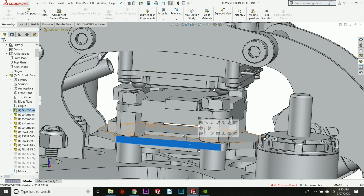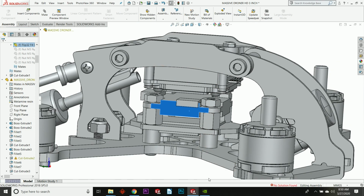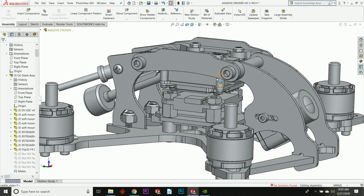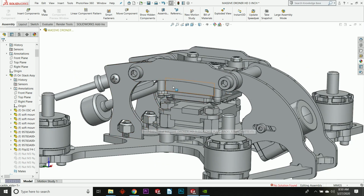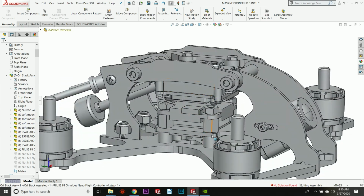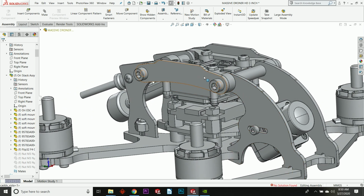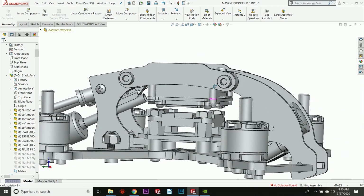So you've got your all-in-one ESC, you've got your flight controller, micro flight controller, and then just stack this thing on top of it and run really long screws through. That, in my opinion, doesn't work very well. First of all, you have a stack that is extremely high up, okay? So when you have a stack that's that tall and you go crashing into things, I'm sorry, but you're going to run the risk of damaging your stack and damaging components because it's just so tall that there's a huge moment that's put when, 70 miles an hour of ground or race gate comes smashing into the side of this thing. It makes things bend and move, and you can really damage things.